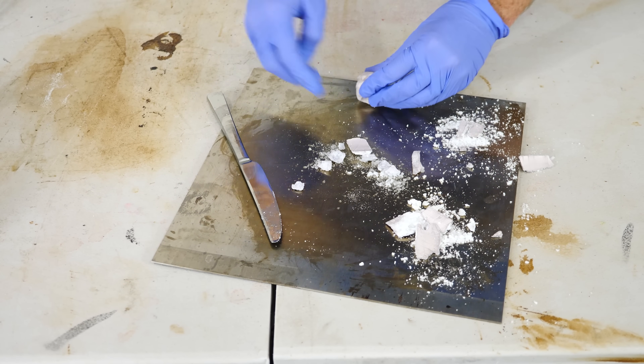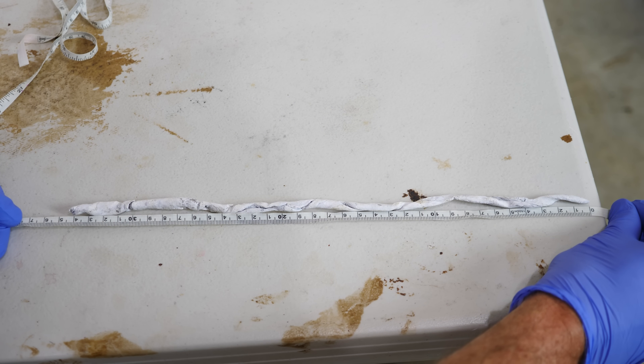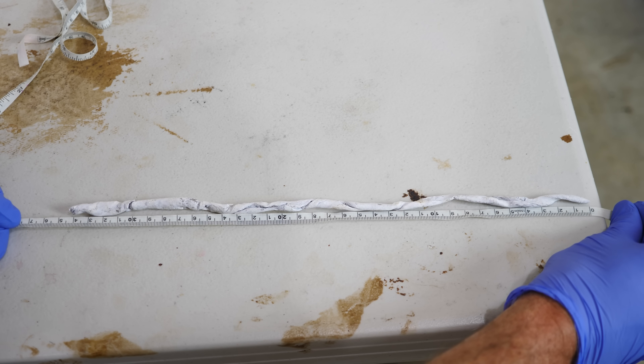The metals I've shown here don't actually have a very large coefficient of expansion. What's cool about sodium metal is that it has a huge coefficient of expansion — it's about 10 times higher than iron. What this means is we should actually be able to see the change in length or volume of a piece of sodium. I have a piece of sodium here, so I'm going to smash it down and roll it into a long rod. Here's our sodium rod — let's measure it. We get 34 and a half centimeters.